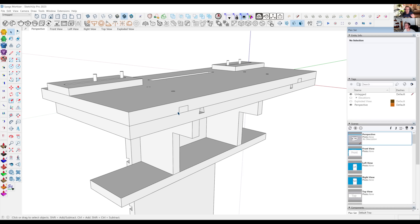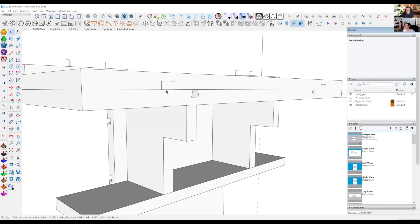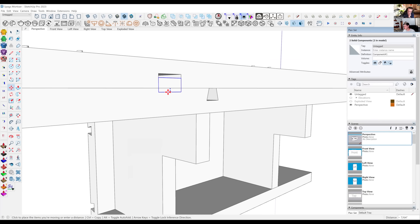The top itself is three-quarters of an inch — this is a guide bushing system, using something like a five-eighths guide bushing. The problem is it's using three-quarters of an inch thick material on the top. Is there any reason we can't make that top thinner and go with half inch instead? Because the thinner it is, the more depth we could potentially get. Right off the bat with a three-quarter inch top, we're eating three-quarters of an inch in bit extension, plus additional vibration and chatter from having the bit extended that far.